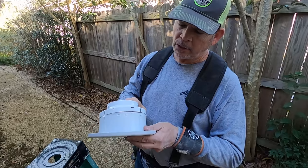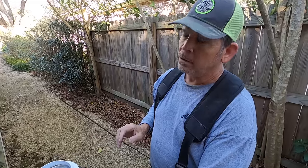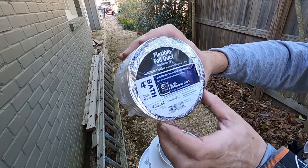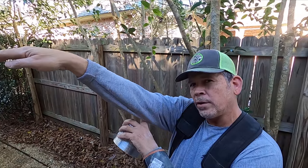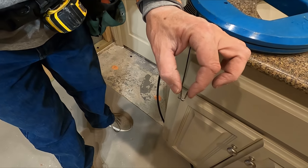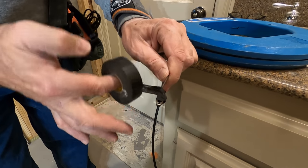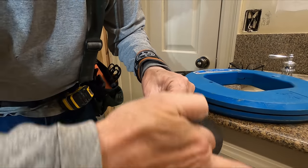We've got the hole cut. The 6-inch template was actually a little small - we had to enlarge it to about 6 and a quarter inch diameter. Now we're ready to run our ductwork. I got this flexible foil duct for bathroom exhaust fans. I'm going to get outside with the fish tape, push it in towards Jordan and he's going to try to grab it. But before I take the fish tape outside, I'm going to close that hook up and tape it, because that hook will catch every single thing in the attic in its vicinity.